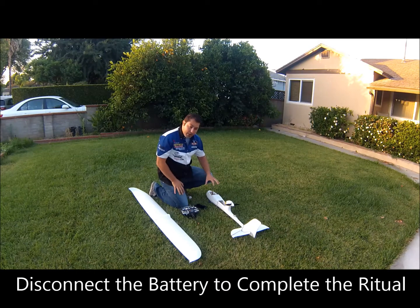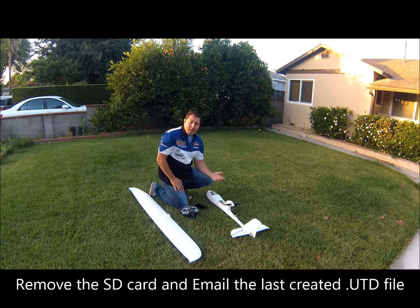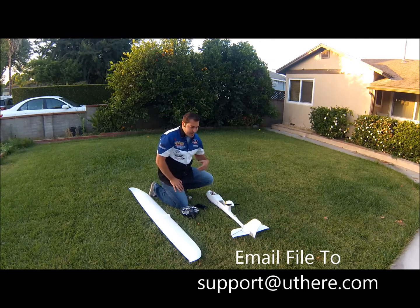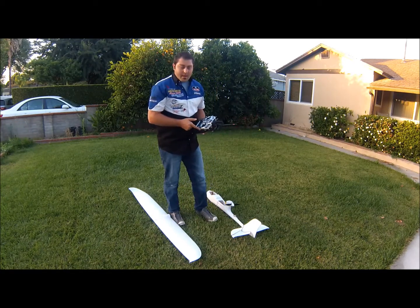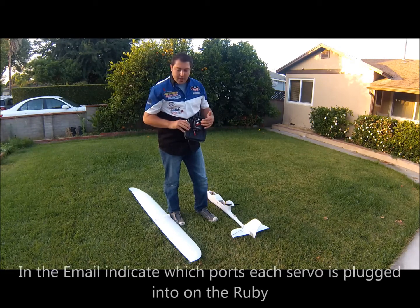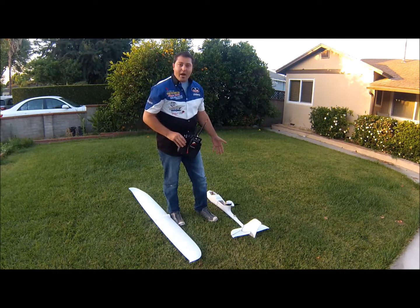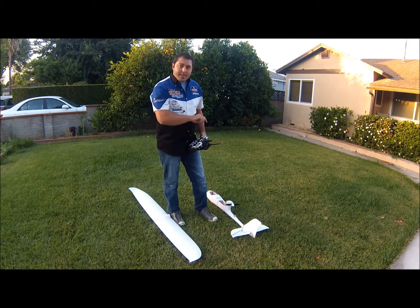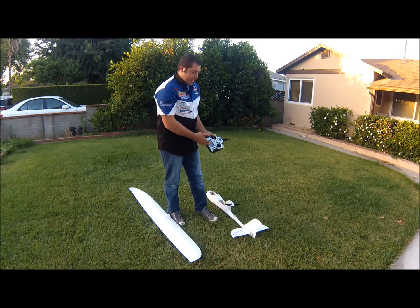Ruby has now mapped all the controls from your transmitter onto the Ruby. Take out the SD card, pop it into your computer, and upload the file to support at youthere.com — I'll put the link in the description below. In the email, let Jim know what kind of transmitter you're using — whether it's Spektrum, JR, Futaba — and also if you're using any long-range system like I am with the Dragon Link. Send any other information relevant to your specific aircraft. Jim will rework the controls, send you a new file and possibly some firmware updates, and you'll upload that back into the Ruby and you'll be good to go.